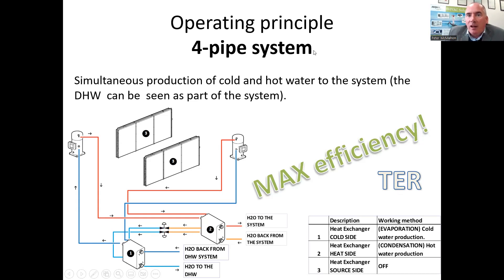So those slides show the difference between a chiller with a recuperator and a multi-functional heat pump. The multi-functional heat pump can give you whatever you want whenever you want — cooling only, heating only, or simultaneous heating and cooling. The chiller with a recuperator can only give you heating when you have a cooling demand. My son, who works with us, wanted an explanation to pass on to the consultant this morning, so I hope this satisfies that requirement. Thank you very much.